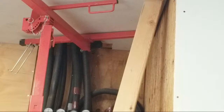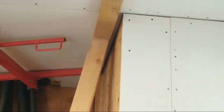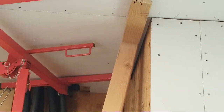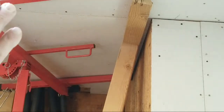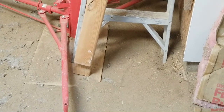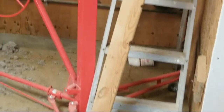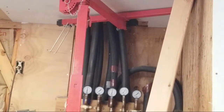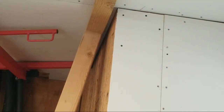All right, that's the drywall tee, and it's holding it up tight right there. I got busy with this video and left it out of the equation. You can put that anywhere you want on your ceiling to hold your drywall up and tight. And I'll show you something else. You want your tee longer than the room is tall. So that's about a 4-inch extension down there that I scabbed onto the side so I can make it tight. Now this room, most rooms you want maybe an inch more, 1.5 inches more. You want it longer by about that.